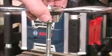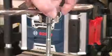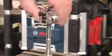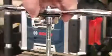Notice how the cutting teeth on this die taper back to nothing. This is the bottom part of the die that goes over the bolt to begin the cuts. We just set that opening over the bolt, hold everything level, and start turning it slowly to let it engage the threads. There's several good threads above the damaged ones that'll let us get this die aligned and started properly.